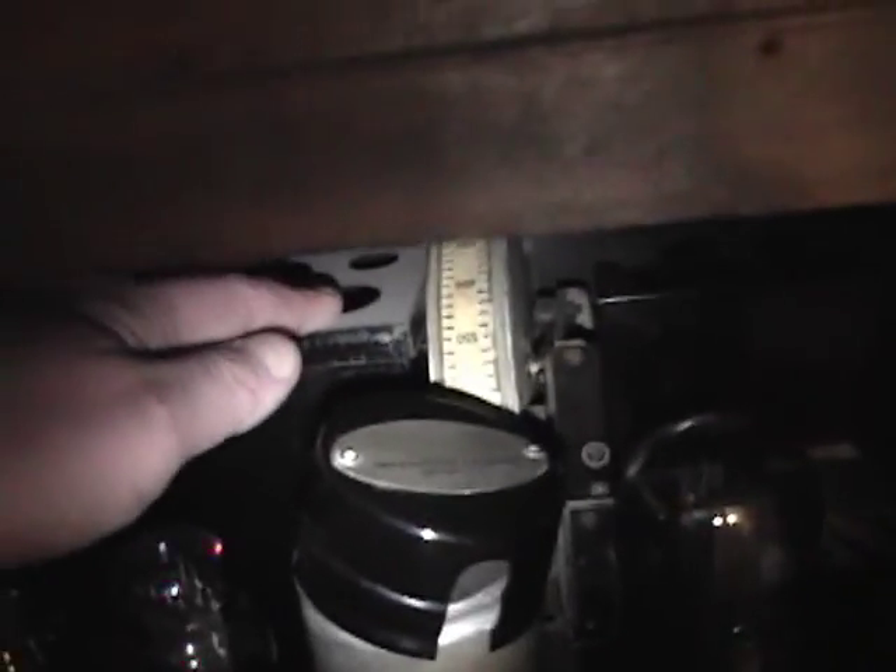The way this really works: the antenna goes into the pre-selector, which has no tubes — it's just a big tuning unit with a wire sticking into it, no actual electrical contact, just a wire rod. Inside is a 6-tube wide-band amp. Basically whatever signal comes in gets amplified a lot and then fed to the audio amps, so all the tuning is done inside the pre-selector. I believe they did this because they didn't want to pay RCA for the patent rights to their superheterodyne, so they came up with this novel, wacky design.